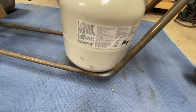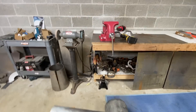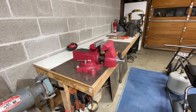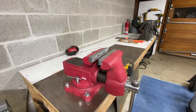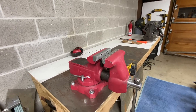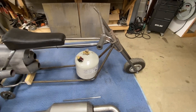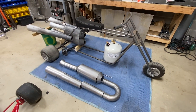All you have to do if you want to make a bend like that is take that piece of tubing over to your vise, put it in there, and take a torch — I'll actually do a video so you can see how easy it is. It's just a weed burner, but it heats up really fast. It'll heat it up and I'll show you how to bend nice perfect bends. You can't just heat up a tube all red hot and pull on it — there's a trick to it, but it really isn't any big deal and anybody can do it in their garage.